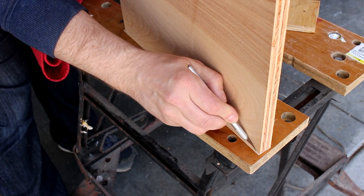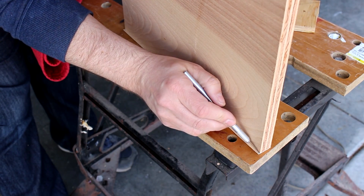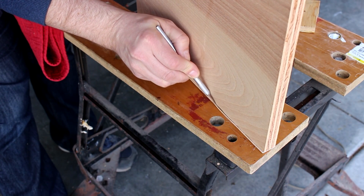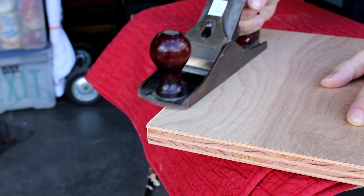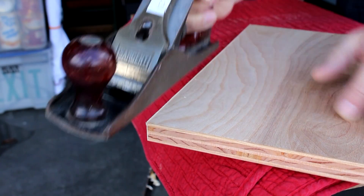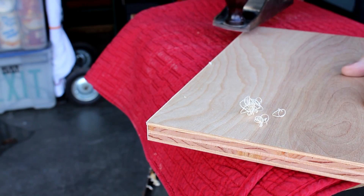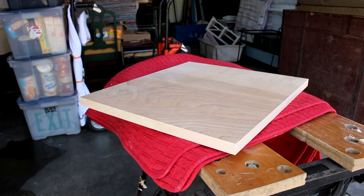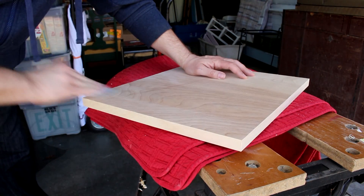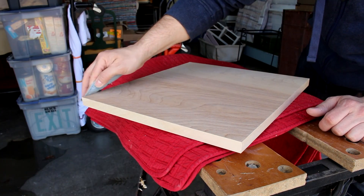On the long edge, you can do it with the knife also. They also make tools that you can buy to shave this off, but I also like to use a plane, as I'm doing here. This works really well, and it's kind of fun. I like to tilt the plane a little bit, angle it away from the plywood, so you don't end up grabbing the plywood and tearing out the grain, because the veneer is really thin on the top of the plywood.